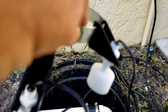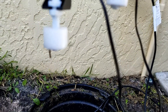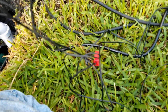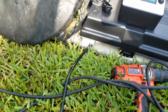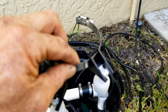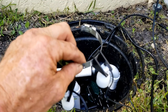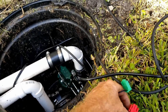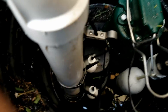Now we go ahead and hook up the battery and control box. On this particular model of battery backup system you can see there are two little sensors. One I assume kicks on the actual pump and the other is an alarm. They are color-coded — there's a red clip, a green clip, and a white clip to power the pump. This just clamps onto the riser and as water comes up to that level it triggers either the sensor to kick on the pump or to sound the alarm.